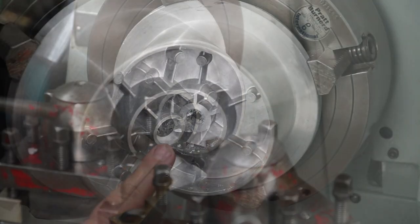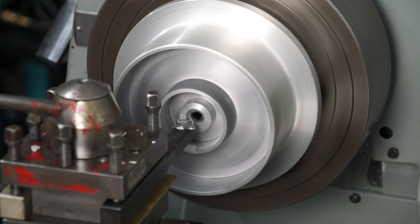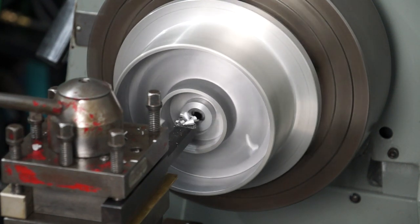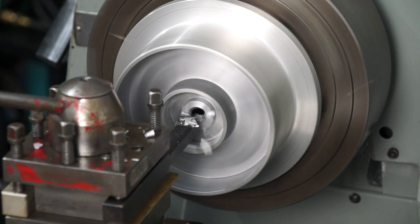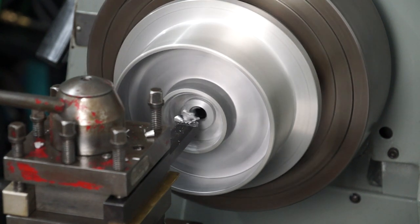Just a different camera angle here so you can see a little bit more of the internals. You can see I'm taking a fairly deep cut — a good width of cut — getting rid of that original boss in the cast aluminium. The chips are coming off there like butter, which I'm quite satisfied with. This is a really odd boring bar that was given to me a long time ago by a very good friend of mine.